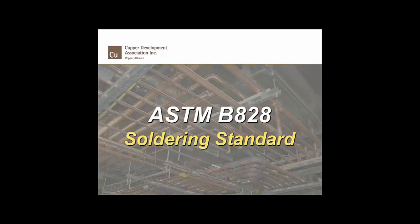The big deal today is trying to explain what's going on with respect to soldering some of these newer no-lead copper alloys. There is a standard out there, which is the ASTM B828 standard. It is listed in every major model plumbing code as the process and procedure that needs to be taken in order to make soldered joints.